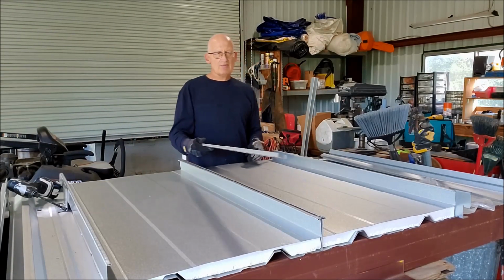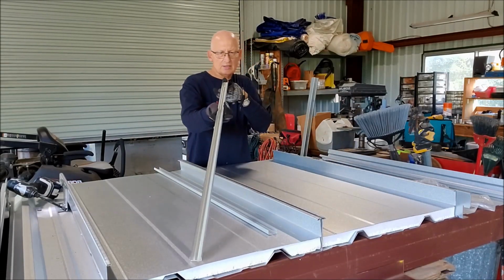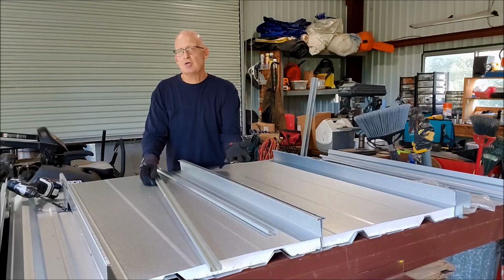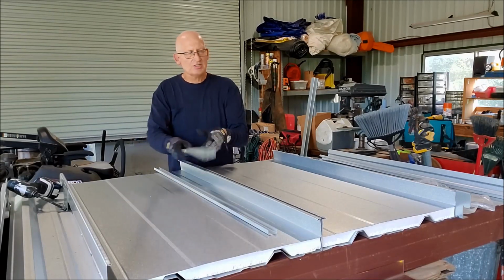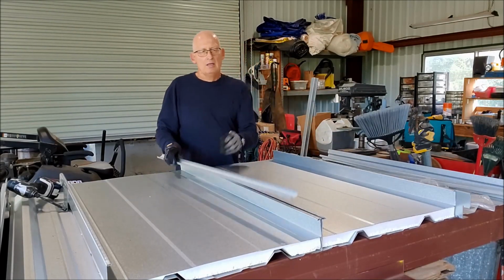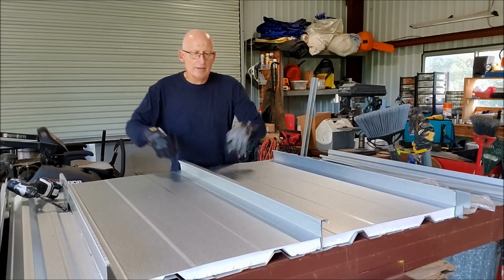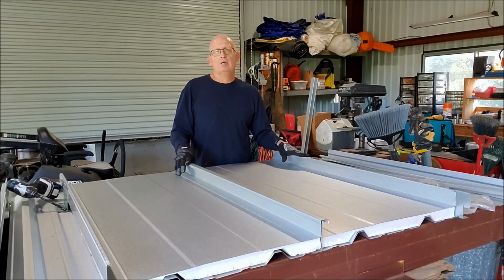Like I said, the seam cover, as we make it for real, is going to have these 2 beads of sealant in it. The sealant sits on top of these two hems here, so there's no contact between the panel and the sealant, so it makes it a lot more watertight. This one doesn't have the sealant on it, so I can get it on and off. The cap goes on, seam it, bam, you're done. So now you've got a beautiful roof.